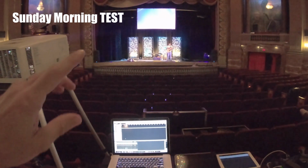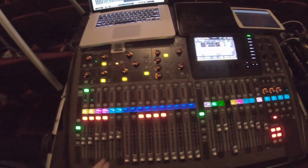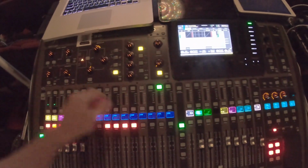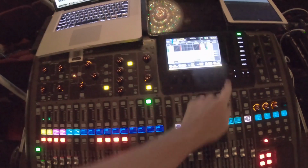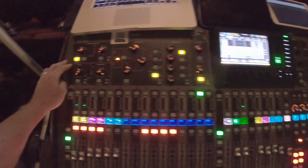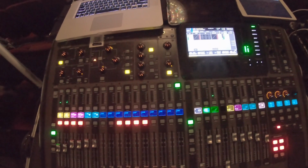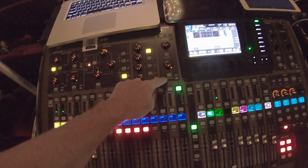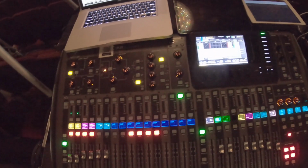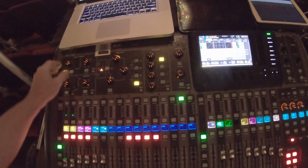All right, so we're all set up. We've got our folks getting set up on stage this morning. And down here at the board, just a quick little thing I'm going to do. Remember, we plugged these into 31 and 32. So I'm going to come in and go ahead and select 31. I'm going to link these channels because it's just going to be a little easier to manage. And then I'm going to hit the phantom power up here. And that should give me phantom power on both, which it does. Now, I'm also going to make sure that I remove these from the stereo bus. I don't need these going into the house because they are, in fact, house mics. Anyway, so that should give us some gain.